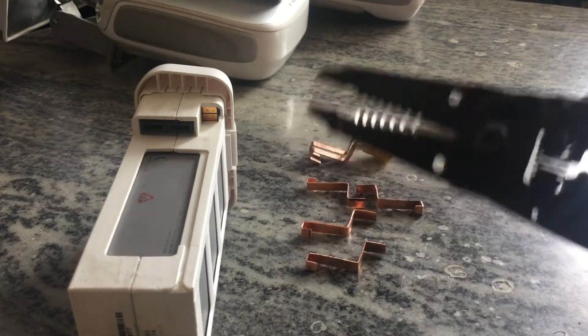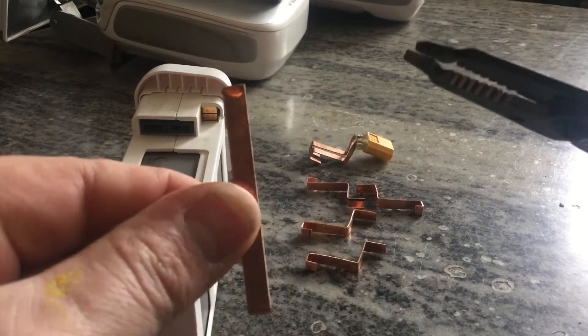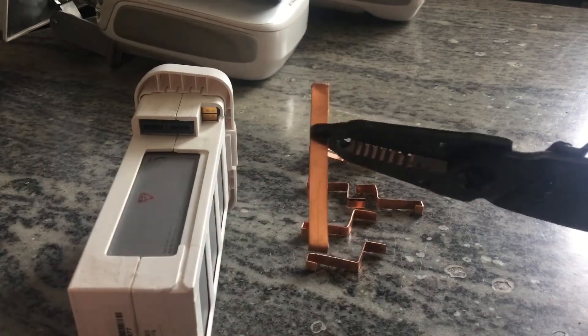The first step: this is about 55 millimeters long copper wire plate wire. I make the first bend here like this — try to keep it perpendicular and straight as you make that first bend. You don't want this first tab to be too long. That's the one that's going to clip into the battery. If it is too long, it will interfere with the clip inside the P3. Then I adjust that and make the second bend.